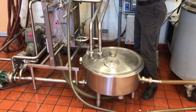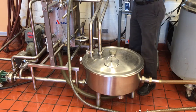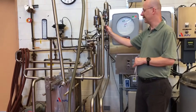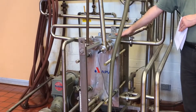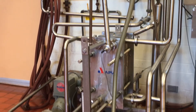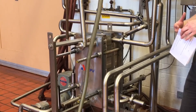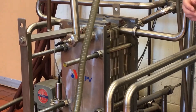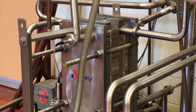If pressure and temperature are okay and there are no leaks in the system, our finished pasteurized milk exits the pipe and goes back into our plate heat exchanger. As I mentioned earlier, we are utilizing the warmth of the finished product to transfer that heat to the incoming raw milk — going into the regeneration section. The milk is now traveling in the opposite direction, being slowly cooled down while heating up the raw incoming milk at the same time — counter-flow, going in different directions.